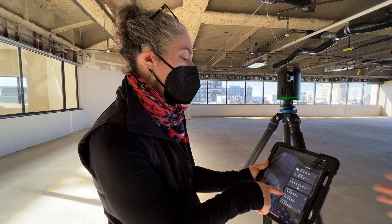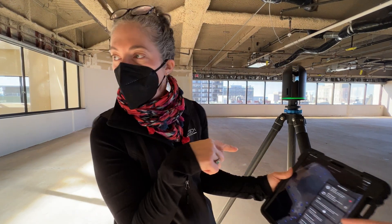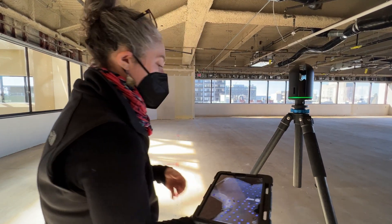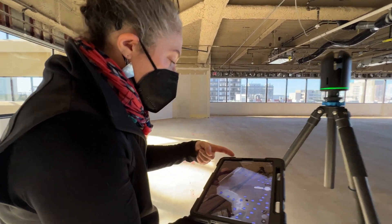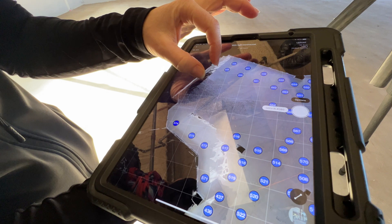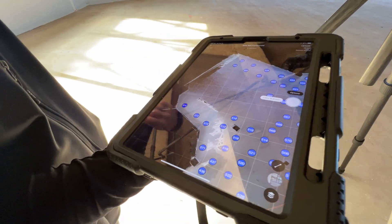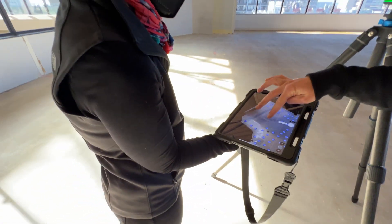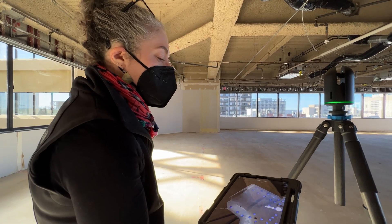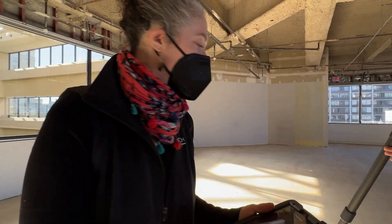What do you recommend for this? Low is about three feet, with medium I go about 10 feet, and high density is probably at least 15 feet between scan positions. Given that, each of these grid squares represents about 12 feet, so if we wanted to do 10 or 20 feet in each direction, three scans here and three there might work — but it depends on whether we're doing medium or high density. Let's start with medium. Definitely not low. I use medium generally for bigger spaces.